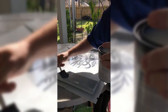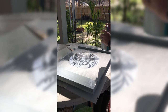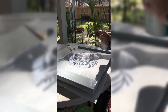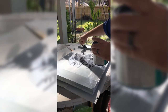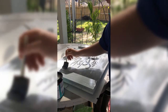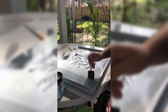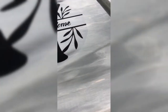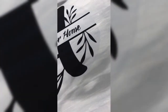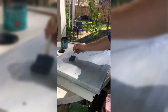At that point, I started the clear coat. I'm using Polycrylic by Minwax — a great product I've used on several projects. One thing I really like about it is that it tends not to yellow like some other clear coats. As you can see, I'm putting on a couple of coats — front, back, and sides — sealing the vinyl underneath and giving extra adhesion to the edges so it won't peel up. This way the vinyl is actually under the clear coat.